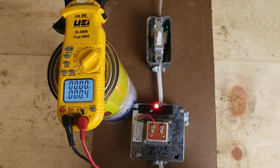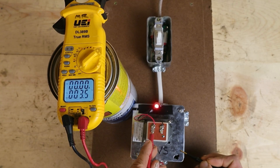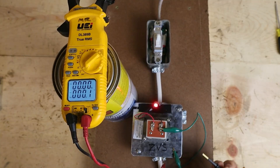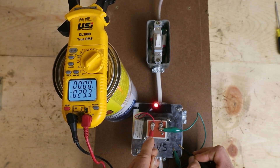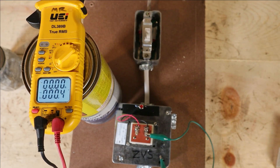Another very important thing to understand is probe placement, because your multimeter needs proper reference points to determine potential differences that give you accurate voltage readings. When we were only reading 5 volts between the load and the ungrounded metal box, we were giving the multimeter two reference points that were not part of the same circuit — for a multimeter, this was like trying to compare apples to oranges. Once we grounded the box from the common terminal, we made that box part of the circuit and the multimeter had proper reference points.